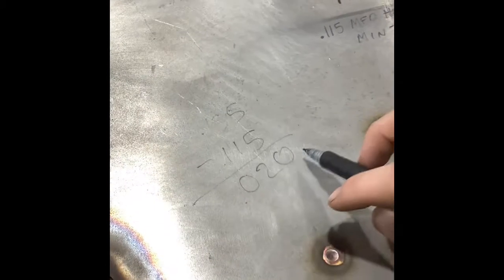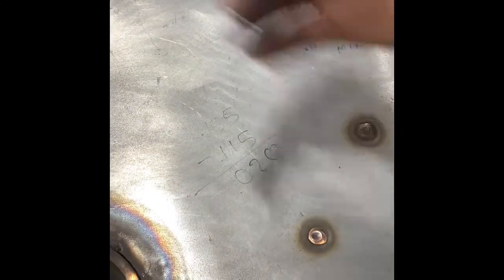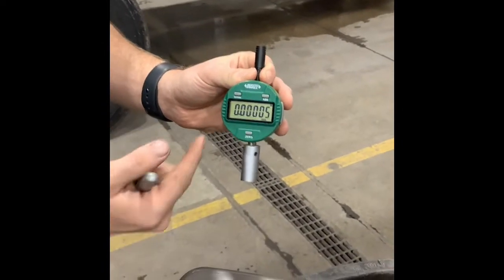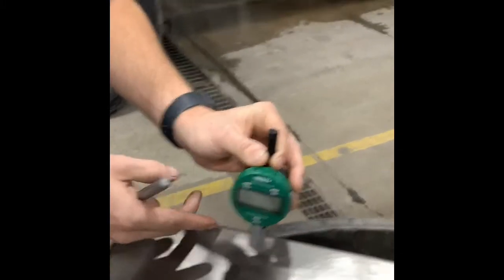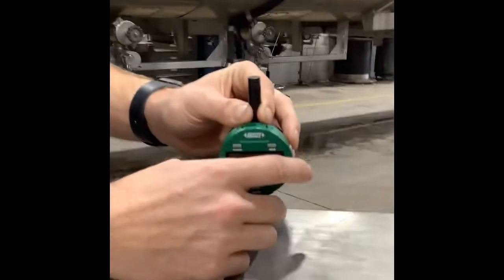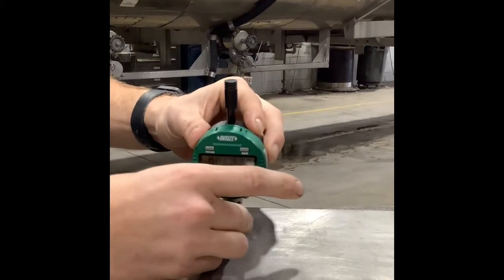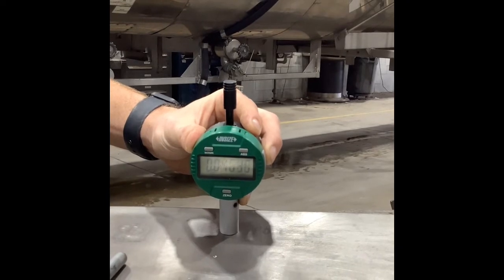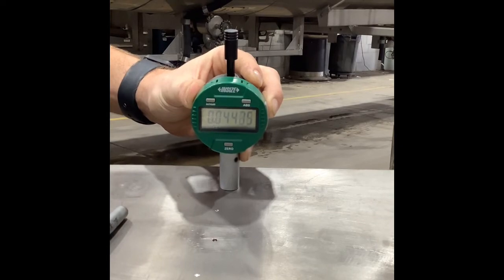And this is the deepest pit that we can have — it's at 0.020. So if this is our barrel and these are our pits, you're at zero when flat. You're looking at these first three numbers — 0, 0, 0. Get it as flat as you can, drop your gauge in there, and hold it as steady as you can. That's giving us a reading of 0.0454.